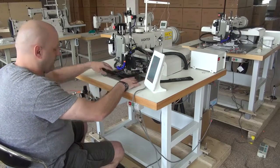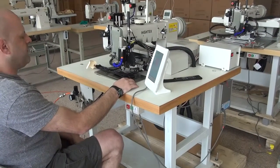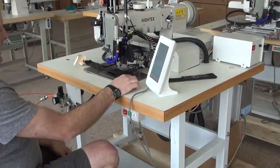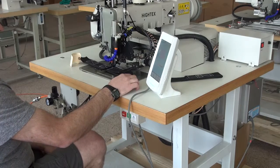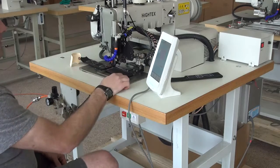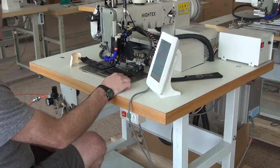On the floor we have two pedals. The pedals on the right-hand side are used to actuate the clamping mechanism. To activate the mechanism, we push the pedal on the right-hand side once and then a second time. That clamps down both of these clamps, and then I'll push the pedal on the left-hand side and that will initiate the sewing sequence.